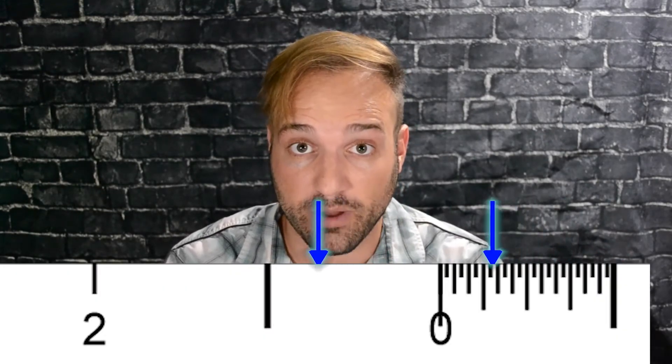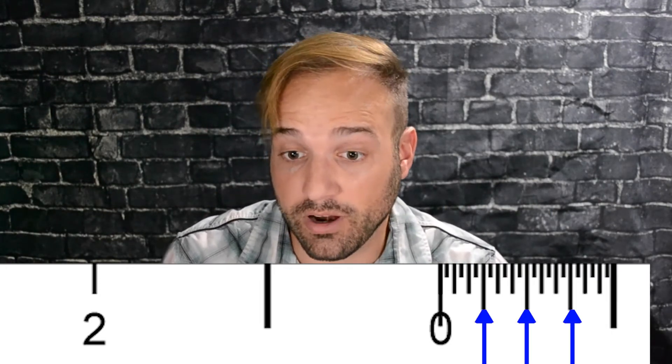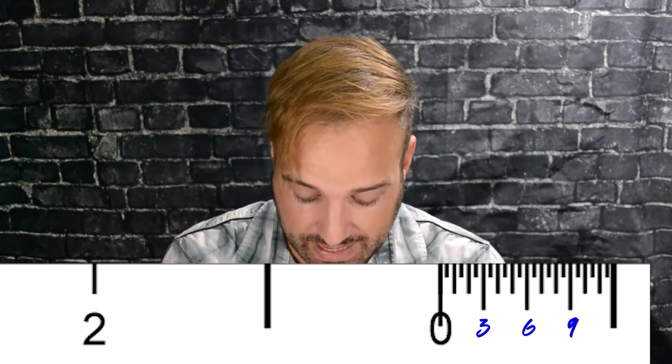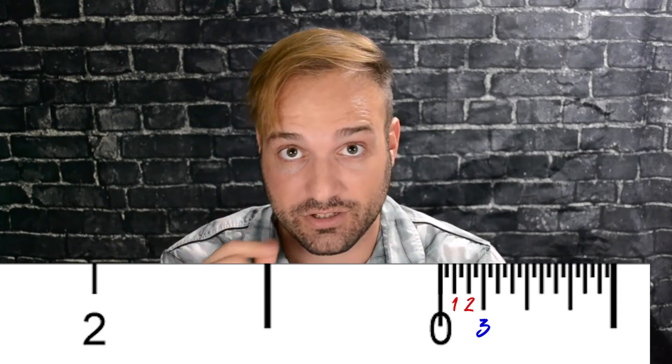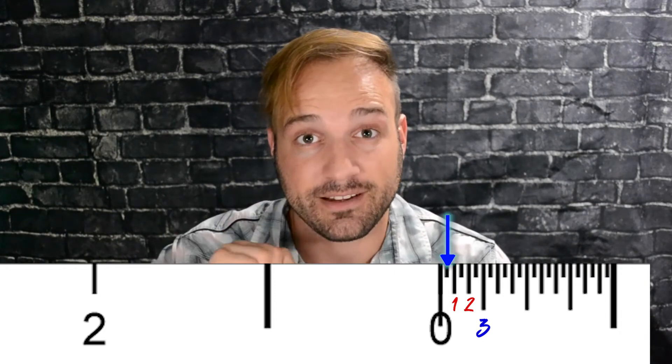Now, how about when things are like two feet six inches? Those little lines on the outside of the zero that I told you to ignore — those actually help you find your inches. If we had all those little tiny lines going all the way across, this would get really confusing really fast. For inches in the half inch section, notice from zero to the edge equals one foot, with the three longest lines splitting it into quarters. One quarter of a foot is three inches, so you have three inches, six inches, nine inches. Now let's get smaller. Notice from zero to three, the next longest lines split it into thirds, so each is equivalent to one inch. For half an inch, from zero to one there is a line that splits it in half — so in half inch scale you can get down to half an inch. In quarter inch scale, it splits into quarters and then thirds, but it gets so small we don't have half an inch. In eighth inch scale, it splits in half and then into thirds, so each of the tiniest lines is equivalent to two inches. We're getting so small that we can't really measure fractions of an inch anymore, but we can still measure two inches. That's how you figure out how to use the scale ruler.